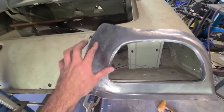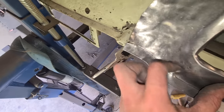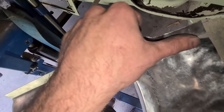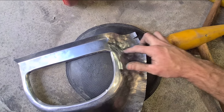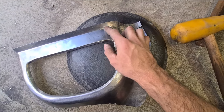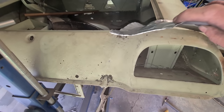It's getting closer now — meeting at the very bottoms but the top still has a long way to go, so more and more stretch on those areas. For the flange, it has to return in so sharp and also be at that level — I've really got to stretch that area out and then run it again with the bead roller to tip the flange. I've basically got to smash that area until it's level with this height so it's all at the same plane, and then I can tip that flange up to bring it at the same level as this.